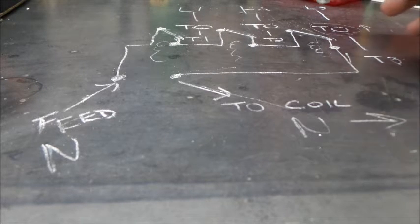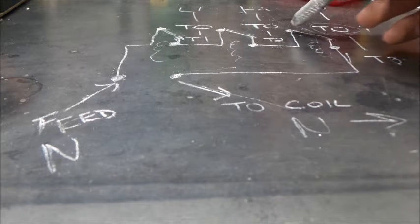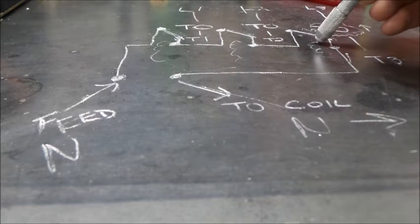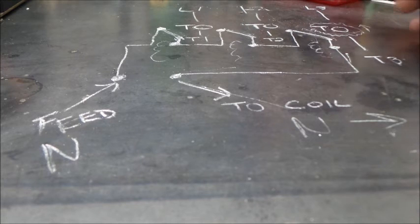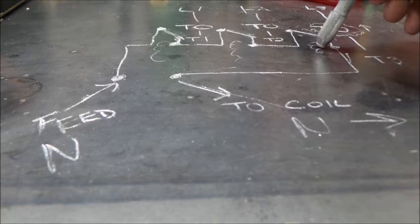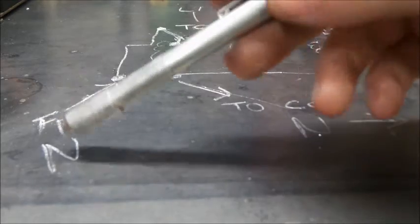will create more heat, causing the solder, at that calculated value, to become liquid, and the spring tension on this mechanical pawl, which is sitting on this cogged overload, will be stronger than the liquid solder. Right now the solder in a cool state is solid, but as we heat up through current, we make the solder liquid. Once the solder is liquid, the spring tension is stronger, and it will open this contact. And once we get that contact open, we can no longer have power come in.